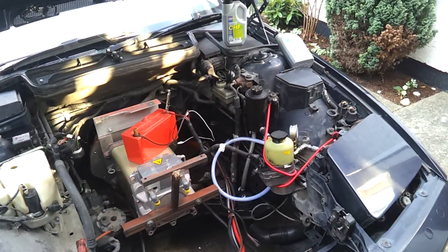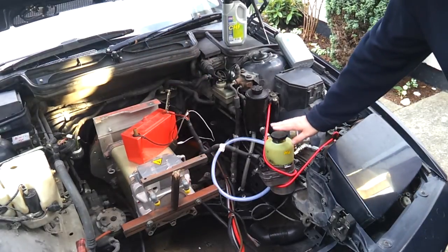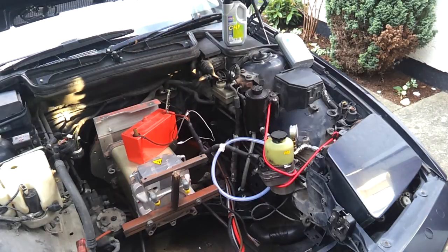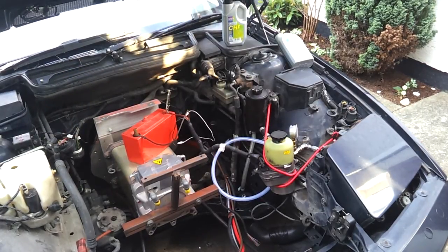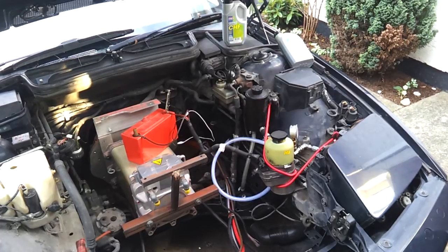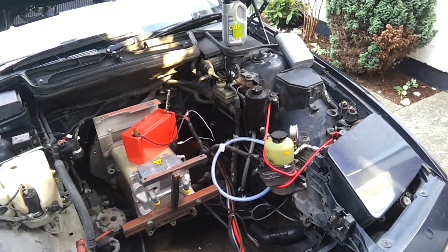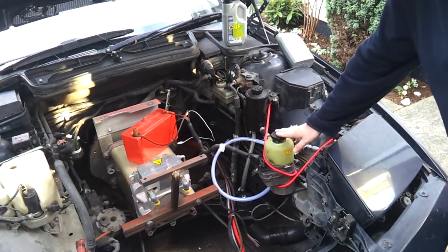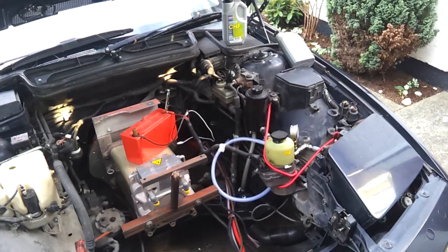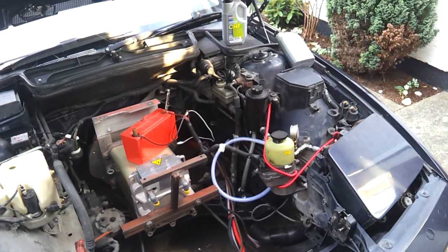In order to do that, some months ago I purchased this particular pump. This pump came from a 2004 Opel Zafira seven-seater people carrier, and like a lot of these electro-hydraulic power steering pumps we see on cars now, it is actually powered by its own three-phase AC motor and a dedicated controller. This pump is very popular with the drift car scene and modified car scene.